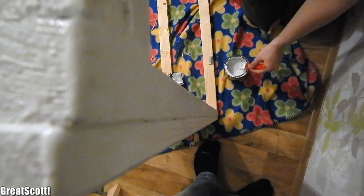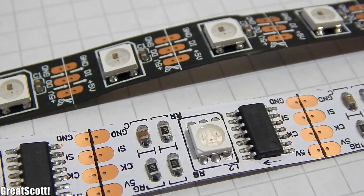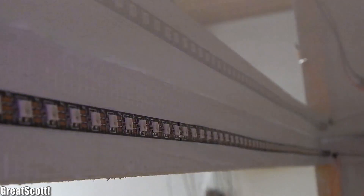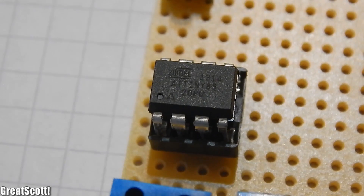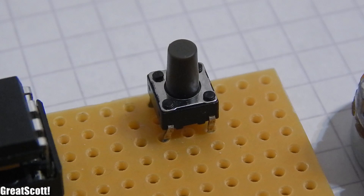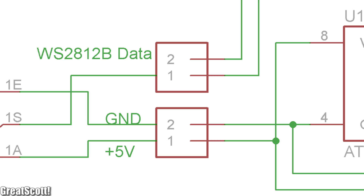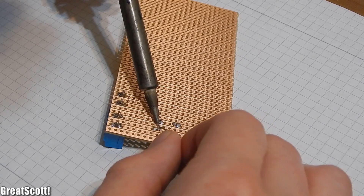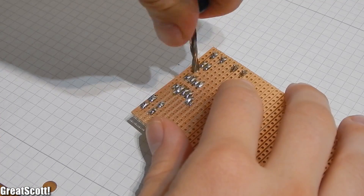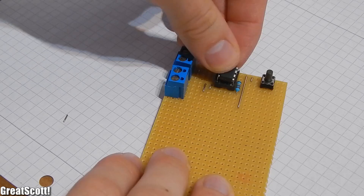Now let's talk about the lighting system. This time I used a WS2812B LED strip, which has more LEDs per meter than the WS2801 LED strip you know from my ambient lighting video. It also only needs one pin of the microcontroller to control it, which is neat. I chose the ATtiny85 to keep everything small and cheap. Here is the schematic: we got one pushbutton with pulldown resistor to select the mode and one 10 kilohm potentiometer to set the brightness. The potentiometer, LED strip, and 5V power will be connected to the PCB with those terminals. The building of the whole PCB only took me 15 minutes and I even made a board layout diagram for you guys, so it should be a really easy build. You can download the schematic, code, and find a part list on my Instructable site — link is in the description.